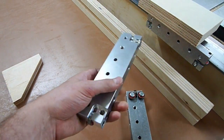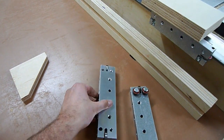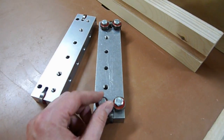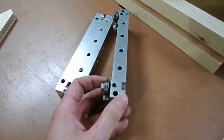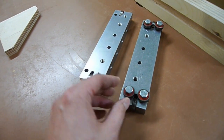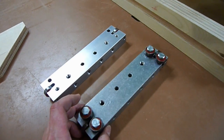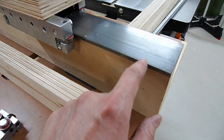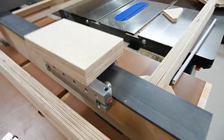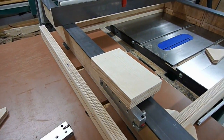These are basically what the linear carriages are — solid pieces of aluminum that have been machined out and tapped. There are bearings on here, set screws, and once you put all the bearings on, there are holes with concentric drill holes that you can tighten down and lock everything into place. It's a pretty easy setup that allows you to fit onto these pieces of steel and lock everything nice and tight, so it rolls very smoothly with not much deviation. The key is to keep everything square and in alignment.